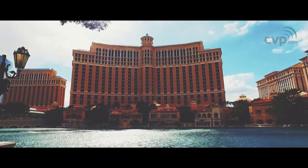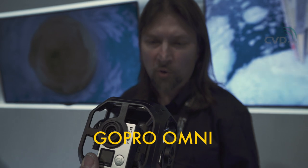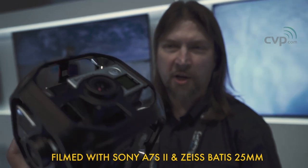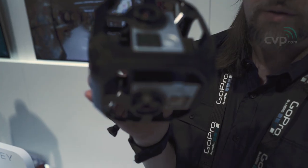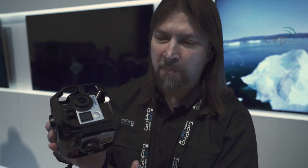This is our six-camera spherical array. The critical thing about it is it's actually synchronized. A lot of the arrays on the market today are using GoPro Hero 4s already, but they're not synchronized. Synchronization is really critical — all these cameras get fired at the same time, all the settings go at the same time. There are Herobus connectors going to each camera, allowing us to drive the settings and start-stop from all cameras, driven by one primary master camera. The rig goes for $5,000 as an all-inclusive package with cameras.